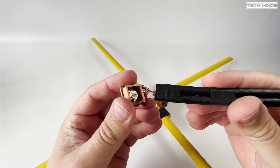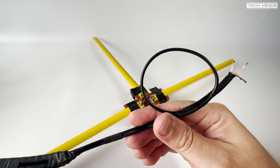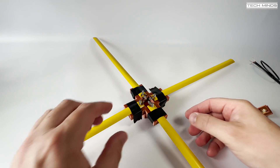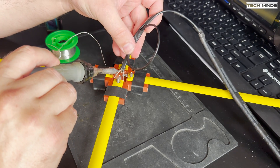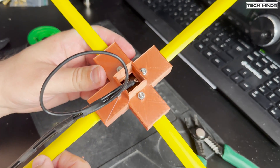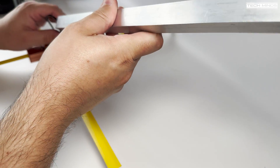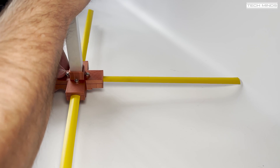The cable harness consists of two pieces of RG174 50 ohm coax — both slightly different lengths which is required for the antenna phasing. These are then soldered onto another two pieces of 75 ohm coax; just some old satellite cable was good enough for this. It's important to keep to the lengths shown on the diagram, or you can refer to the blog post which I'll link below. Soldering the cable assembly was a little tricky and I used electrical tape to make sure no elements of the coax were touching or shorting. The next step was to feed the cable assembly through the longer piece of aluminium tubing. It wasn't quite long enough, but I had to keep these lengths exactly as described in the instructions. I soldered some 50 ohm coax to the end of the 75 ohm coax and then fed that to the SMA socket at the bottom.